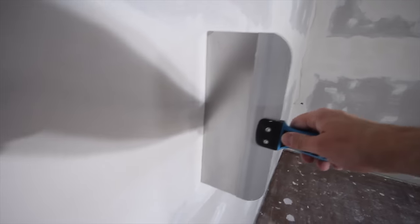The premise of tape and jointing is to cover the joints between your plasterboard with joint compound while leaving the main face of the plasterboard bare. By building up the layers a convex curve is created just a few millimetres deep, sufficiently spread out so that it's imperceptible to the human eye.